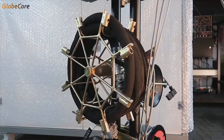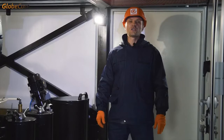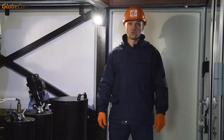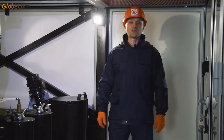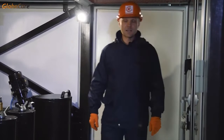The function of the TSS is to monitor and control the level of oil in the transformer. You will find more information on the TSS system in its own dedicated video. We are also aware that regeneration removes all oxidation inhibitors from the oil. A special unit is installed in the plant to add inhibitor back into the oil after the regeneration process is complete.